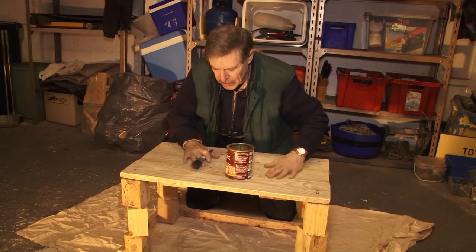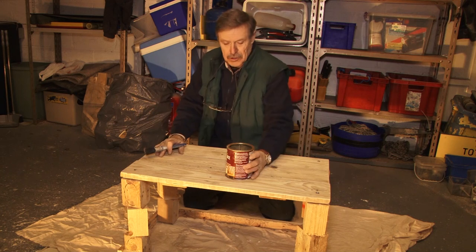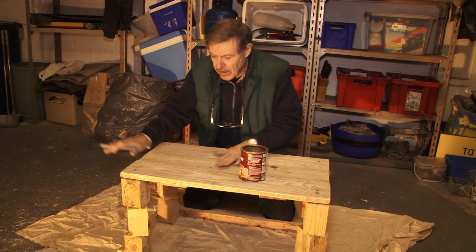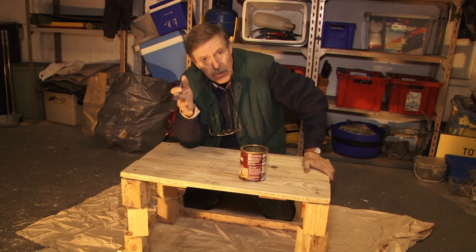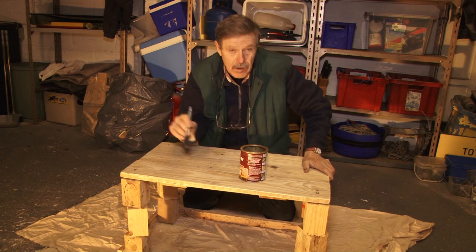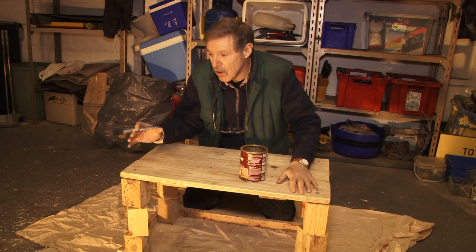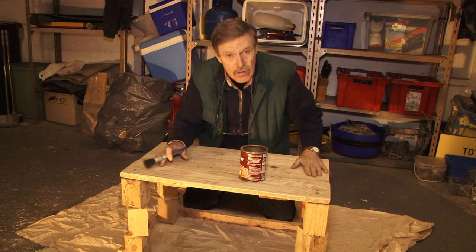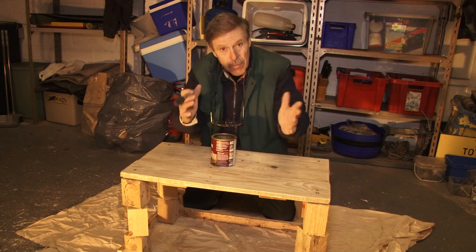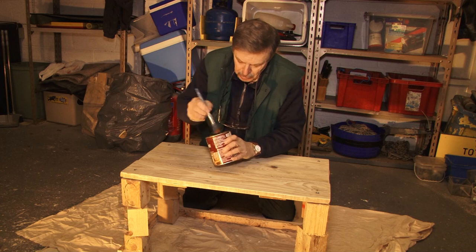Now comes the best bit, and that's staining it. You can paint it, you can stain it, you can varnish it, you can treat it with a wood dye. I'm just using regular furniture stain, but I'm not going to go dark. I'm going to keep it fairly light, because if you put a dark stain on and you don't like it, you can't get it off, you've got to sand it all down. If you use a light colour to start with, you can at least grade it down by going over the top. Say you start with light oak, think, oh, it's a bit wishy-washy, a bit light. You can go medium, you can go to dark oak, three grades there. If you go dark oak to start with, you're going to get stuck. And the fact that I've taken the trouble to sand this wood down, I feel the grain might come out. It's going to show up, albeit it's only going to be in the garden. Let's get it on, see what it looks like.